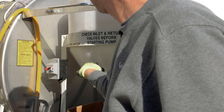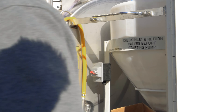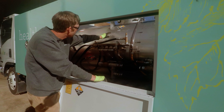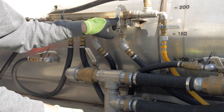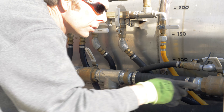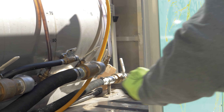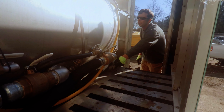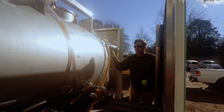I want 10 gallons — it's almost there. Stop, turn the PTO off. Turn the water coming from the 300-gallon off. This 30 is already open, so you open up the 30 that's located closer to the 30-gallon tank. PTO back on, and you're ready to operate out of the 30-gallon tank.